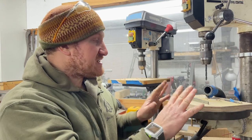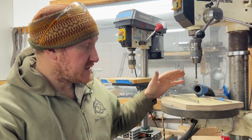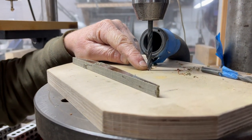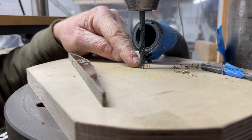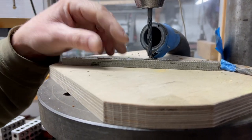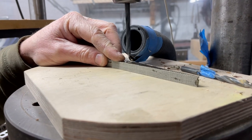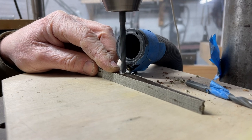I've come over to my pillar drill which is set up for doing my counter bores, with an extra bit of plywood on the table. I set the table height so that when I pull the drill bit down there's about 3.5 to 4mm from the cutting edge to the top of the plywood — that's going to create the shelf. There's a slight recess in the plywood so the tip can pass all the way through. I've got some scrap handle material — a piece of Kydex — to test on. I get the drill running, let the pilot find the hole, then hold the material tight.